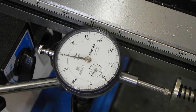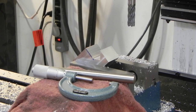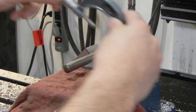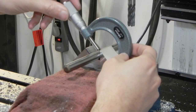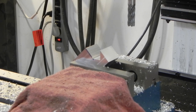Then I should have a nice accurate slot to depth that I can test against. Last night I finished milling the slot for the V-way. It wasn't anything special, it was kind of time consuming and if I had to do it again I think I would just turn the vise around so I could use power feed. But as you can see here, the slot's in place. There are a bunch of steps — let me clear it so I can measure the depth of the slot. If you haven't done that before, you just take a round — in this case a half inch drill blank — and then you just measure it across, and doing a little math you can figure out how deep the slot is and whether you're to spec or not. The next thing I need to do is put the drill chuck back in and drill and ream the two holes for the rare earth magnets.